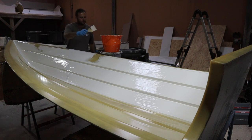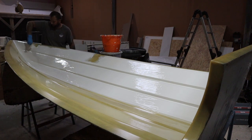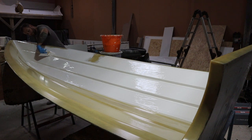And then what you'll realise is the top bits that can breathe, i.e. this lip and the top few inches, will go hard quicker, and it will go off. The styrene slows the process, and slows the reaction, and therefore won't allow the gel coat to go off correctly.